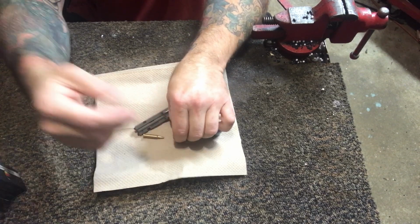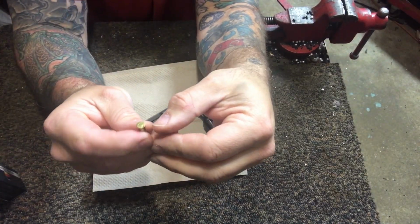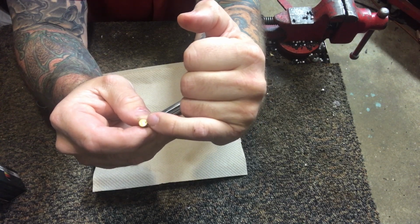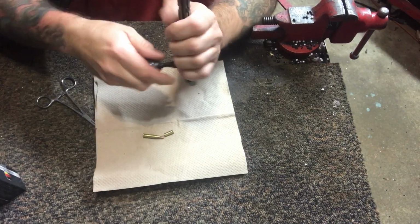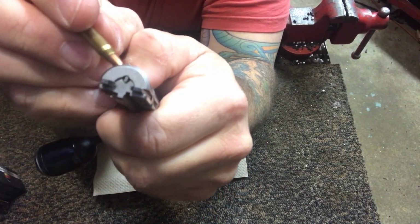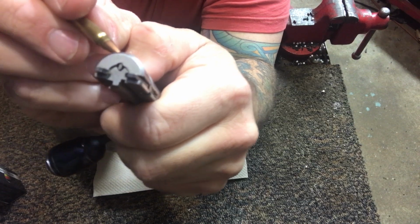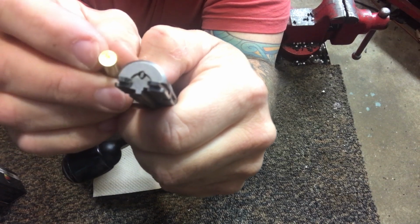And so one of the things that you can realize from what we're talking about today is reprofiling your striker, which is basically removing the impact on the edge of the rim and only allowing it to strike inside the rim where the compound itself is. So how do you do that? Well, on a CZ, you can see the firing pin here. And you can see at the top here, there's kind of a cutout, a slight radius in the actual bolt head itself, just at the 12 o'clock position of the firing pin. And that's to allow for the larger diameter 17 HMR case.